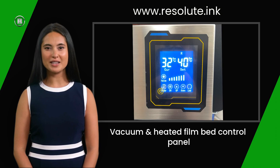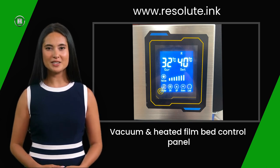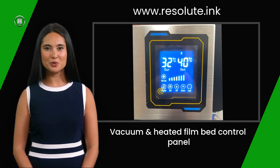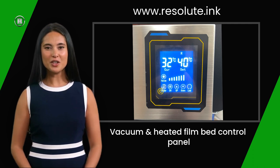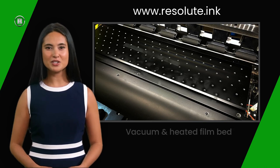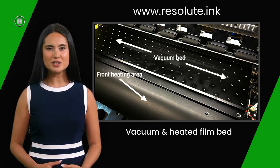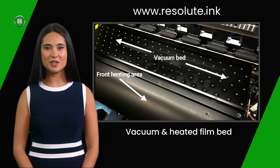Keeping the film at the correct temperature for printing is an important part of the DTF process. The V4 DTF printer has a touchscreen control panel that shows the current and desired temperatures of the front and rear film feedbeds. The V4 warms the film automatically to remove excess moisture and prepare it. It also shows the vacuum bed settings, which keeps the film flat when printing, allowing the print heads to travel just 2mm away from the film's surface for sharper reproduction of graphics. Once the printer is configured on installation, these settings will rarely need changing.